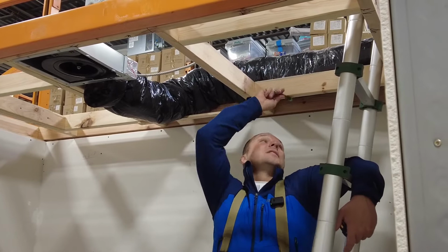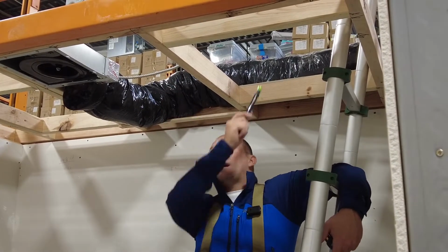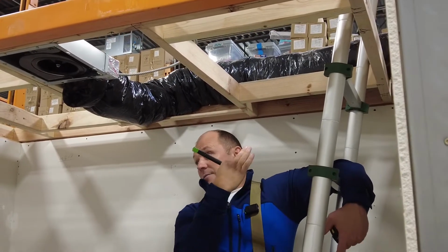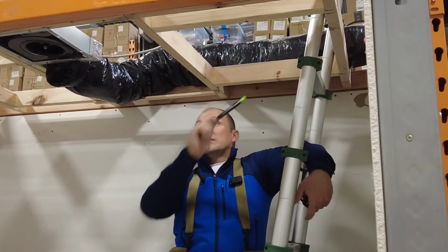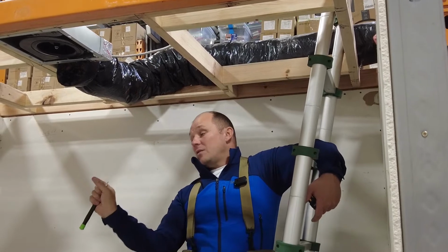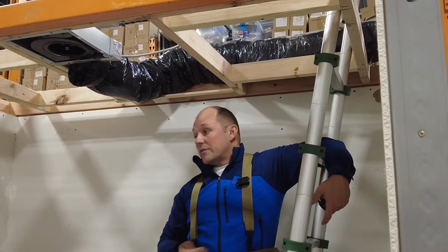These are called headers. Typically, sometimes these aren't even nailed in. So never put your ladder against a header, always the bottom chord. So like here. Just to be more comfortable, I went like this, right? Doesn't work that way. Any weight on these sometimes falls through. We never step on these headers. They could be just a 7-penny nail, which means it's only in that wood half-inch. You'll fall through and break that whole drywall out, get hurt, everything else.